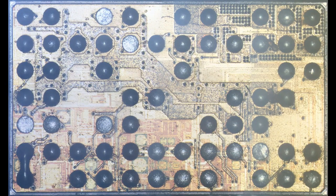We're now looking at the Wi-Fi chip from Cypress Semiconductor. You can see a whole bunch of what looks like gray spheres — that's in fact what they are. These are solder balls; they connect directly down into the silicon die. This is the cheapest form of packaging for silicon, but also the most superior if you're worried about signal integrity. The connections between the component and the circuit board are as short as possible, which is quite helpful for Wi-Fi and getting the antenna out correctly. Below that there's an insulation layer — it's polyimide — and below that the metal of the semiconductor, and then below that the actual semiconductors.